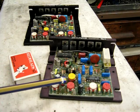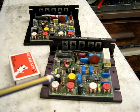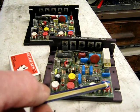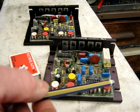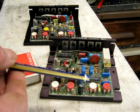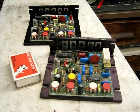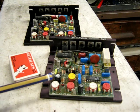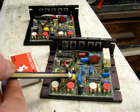On the circuit board you have these trim pots — it's the same on both of them. These two here are factory-set compensation trim pots; you shouldn't need to really touch those. You can adjust them if you wish — KB Electronics have instructions on their website on how to do that — but generally you leave them alone. These three here are the ones you can fiddle around with: this is your maximum motor speed, minimum motor speed, and motor acceleration.